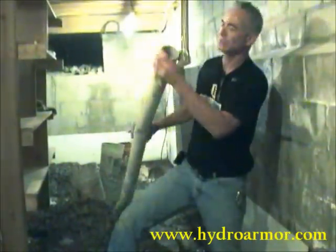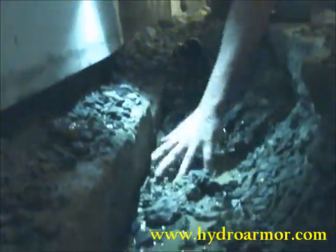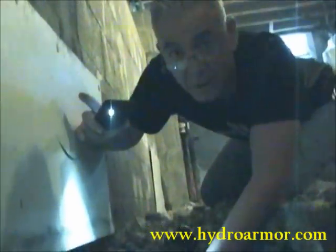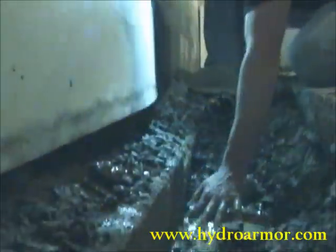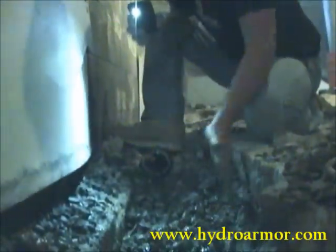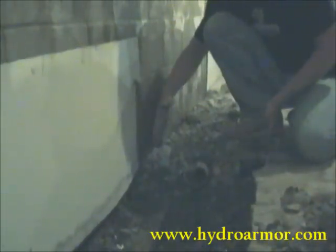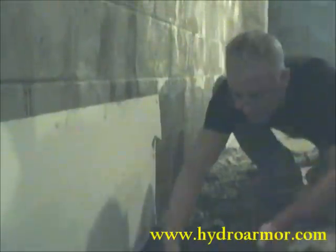This is three-inch garbage. Look at this — this is the PVC pipe, all the way up here. Down here is where the water is. This is the bottom of the footer. I didn't put the water there. If you dig your trench to the bottom of the footer and put your pipe down at the bottom of the footer, there isn't gonna be any water. Here's the pipe up here — this is the width of their trench. The water is down there. The trench really needs to be this wide. $5,000 — can't do a job properly. You can though if you're only breaking out this much concrete. I need to break out this much concrete.